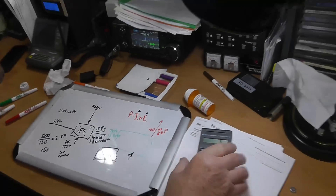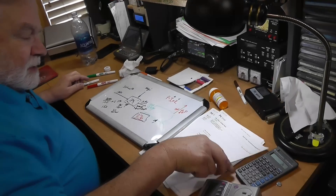So, the answer to your question is no — you don't need a 20 amp supply for running your normal station. What you need is simply 2.5 amps peak, like if you've got key down on CW. For FT8, you're going to cut your power back anyway. But RTTY or CW, something like that. Now, if you put in an amplifier, things change.